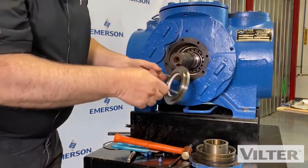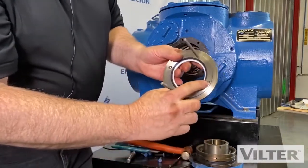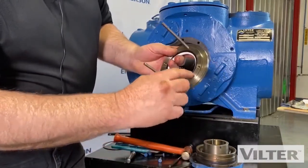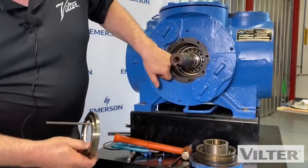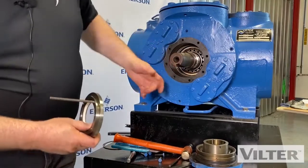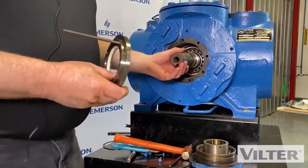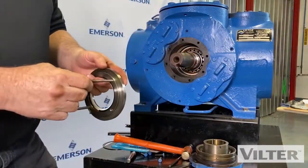So now you can see these are the check valves that allow the oil to go from this direction out the back. And you can see, feed that roller bearing in the back. You can see that's our roller bearing. Remember, that's the measurement we were reading. That was radial. We call that the radial bearing.